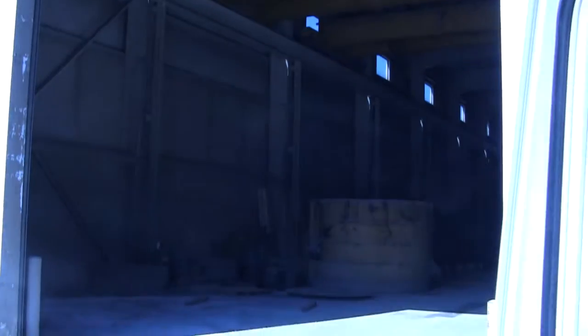Okay guys, we're here. This is the door. Both of the cables are off on that thing, which means that thing's free floating there. Just a small obstruction, the fact that the door's a little bit crooked, is holding it up. If that thing comes down, you've got a ton and a half of door moving at about 70 miles an hour. Basically, you've got a really dull guillotine.